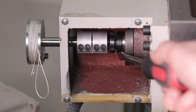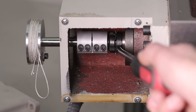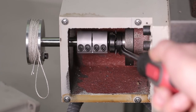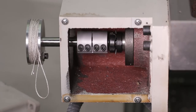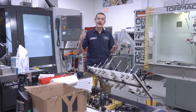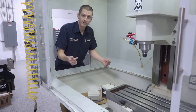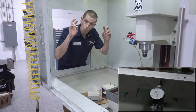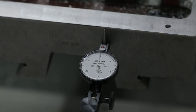These two nuts are what we use to adjust the angular contact bearings. It's this nut right here that we tighten to compress the stack of bearings, and then this nut backs up that nut to keep it from adjusting itself after we get it where we want it. While we've got them set correctly, this is what I call an optional measurement in our workflow — we can establish the baseline. Before we start loosening these, we can take our fish scale, hook on, and start seeing what torque value we get. I'm at about 300 grams — that gives me a baseline of where we are right now. Before loosening the angular contact bearing preload, as I rotate this, I can see the indicator move and I'm getting kind of a one-to-one — there's no slop or backlash.